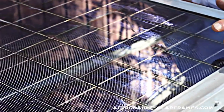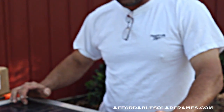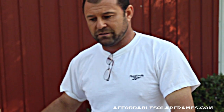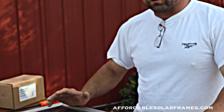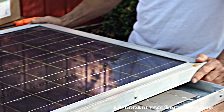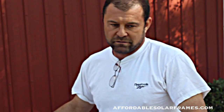The glass we use is clear tempered quarter-inch glass. A lot of commercial solar panels use just eighth-inch glass and they break easy — a 60 mile-an-hour gust of wind and it breaks and the frame is so weak it won't survive. Everything we're building is meant to last 30 years, not just one summer. This glass has a 25-pound-per-square-foot snow load and 100 mile-an-hour wind load rating. I do bring mine in during a hurricane — unbolt them and run them in, just for safety.